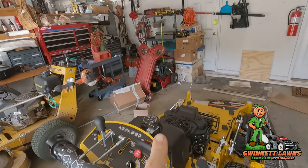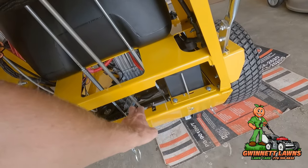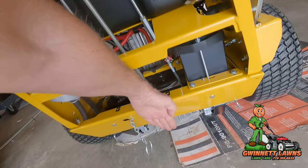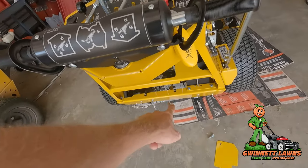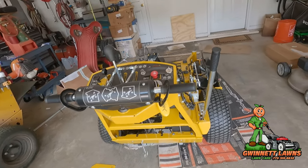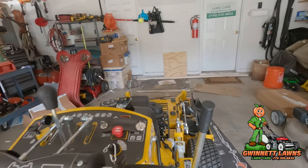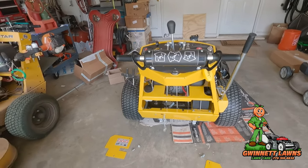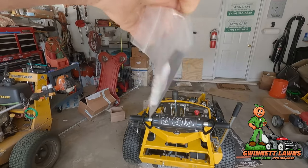If you have a Hustler Trim Star and you want to put a Pro Slide XT on it, I'm going to show you something you really need to add to this purchase to make it function properly so it won't be tearing up your shins. The back of the Hustler is angled down — most other walk-behinds are pretty much straight up and down, but this one is angled back. If you mount the Pro Slide right out of the box to the back of the Trim Star, it will have the Pro Slide, when in its retracted position, angled too far out — giving you the potential to hit your shins.